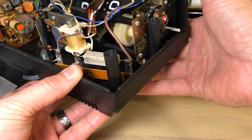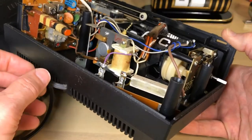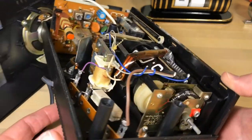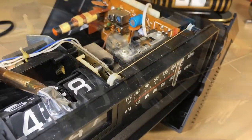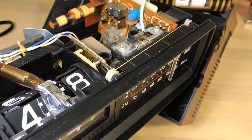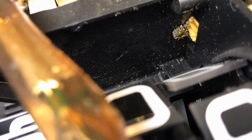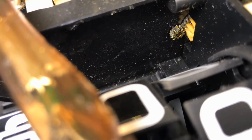What's distinctive here is this runs straight off household current, so if you're working on this with it plugged in - which is not advisable - you can get hurt. That's the motor there, and it uses a sealed can inside a rotating magnetic field setup. The problem: if you look kind of in the center to the left, you'll see the motor is actually working, but on closer inspection it is not turning the wheel that it should be. Once I help it along, it grabs hold of the teeth - so it's pretty clear we have a stripped out gear.